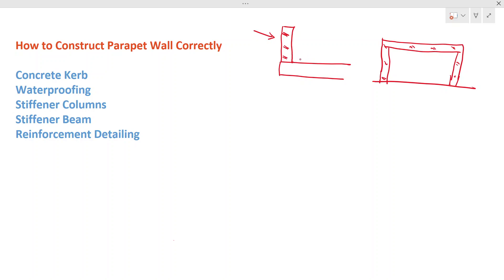Let's start with waterproofing. When we do waterproofing, we have to place the waterproofing sheet or membrane and protect it. If the waterproofing fails — and typically a warranty is about 10 years — water will leak. At the joint between concrete and brick, due to thermal expansion and contraction, water will leak through. The white color staining visible on concrete surfaces is an indication of water leakage.